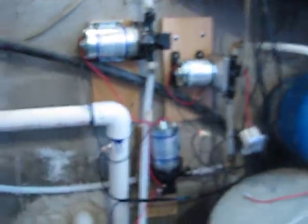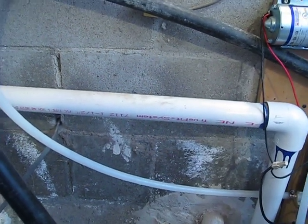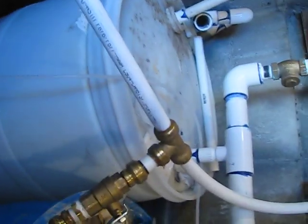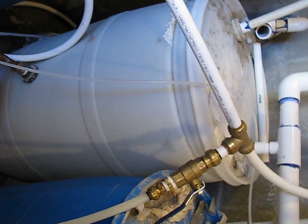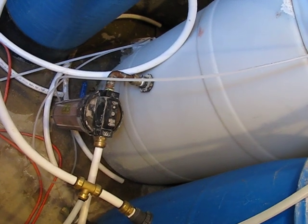From there, let's take a look at how my water system works. I have a spring — this is the water coming in. It's actually at a higher elevation than we are right here, so it flows right down this pipe and drains down into this 55-gallon drum. I use this tank mainly to separate out some of the sand — there's a lot of sand in my spring. A lot of the sand will settle to the bottom. Then I have this filter coming out of the side of that, which will take out the rest of the sand. It will come over to this tank, and that's where I have my clean water stored.